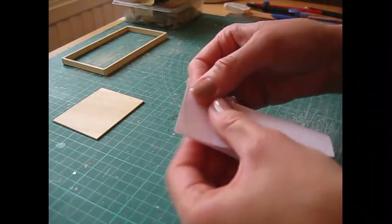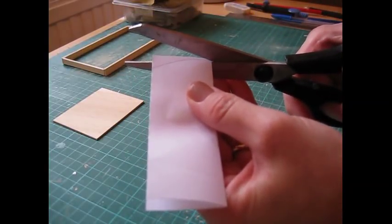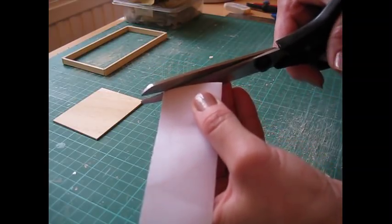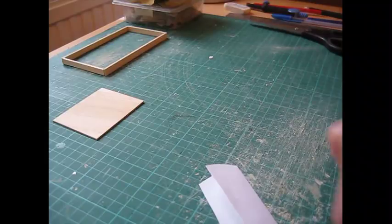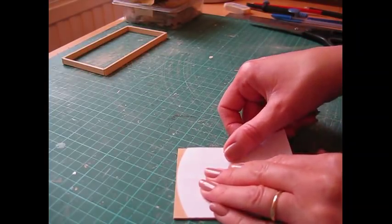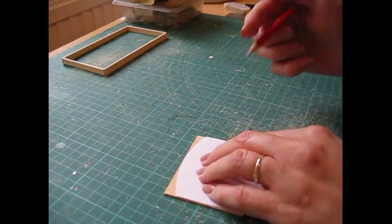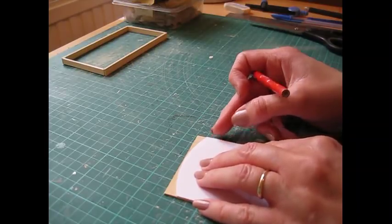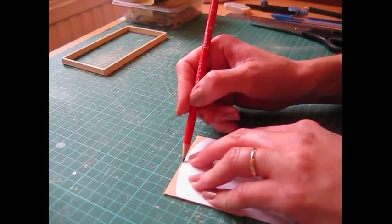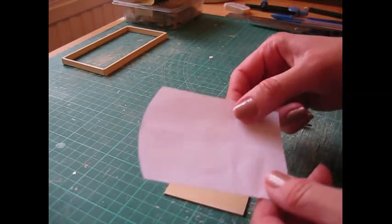Fold the template the other way and cut that out. Then place that onto the headboard so that the top of the paper is just at the top of the board, and draw that onto the headboard making sure that the sides of the paper are in line with the sides of the wood. Keep this template because we'll use it for the footboard and for the head and footboard mouldings.